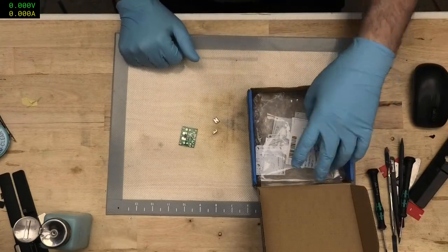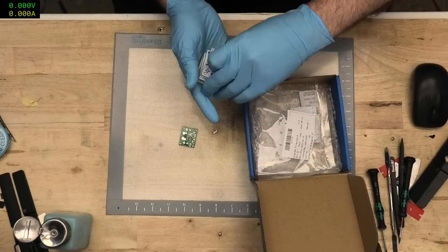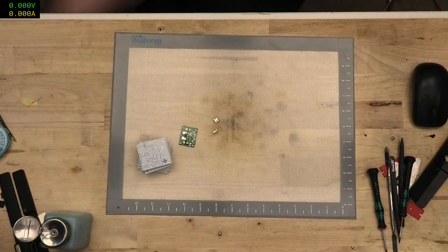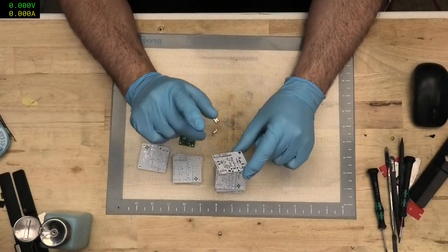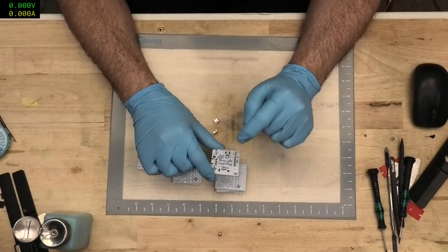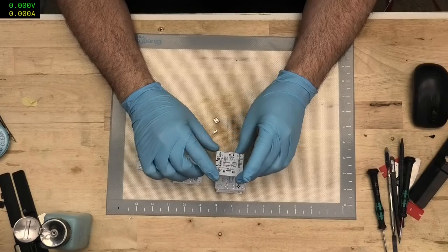Alright, so today I received my USB-C boards that were meant for the INA-238, but I had a routing cock-up. That's entirely my own fault. It was not the fault of JLC or any other thing. It was just me. I was making the part for the INA MSOP, VSOP, whatever you want to call it, and I connected the wrong pins to the logic diagram, and subsequently the routing's all messed up.